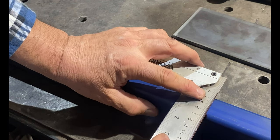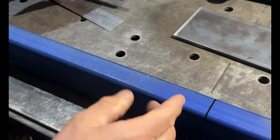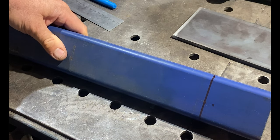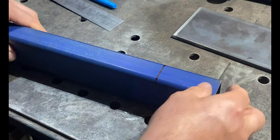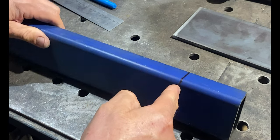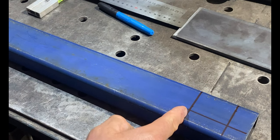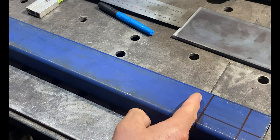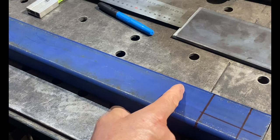Your line follows all the way around the box. It's going to be very hard to keep that square if you try to cut right through it with your angle grinder in one pass, so just cut each side with your angle grinder and you'll get a nice square cut. Cut this off at 75mm in length and this is now ready to weld onto your base plate. The large leftover chunk is also used on the mid frame as a bracket for holding the motors.